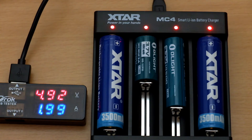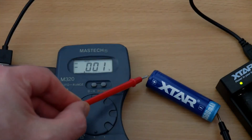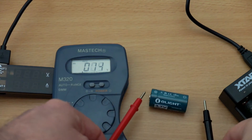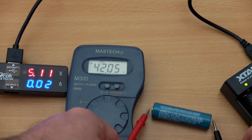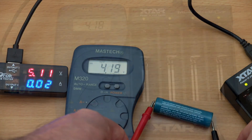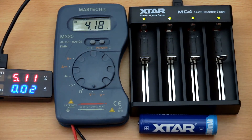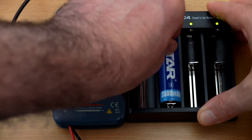Inserting the batteries for termination tests — you can see clearly when it's charging as the LEDs are red, then they turn green when finished. One downside is you won't know how far into the charge it's gone. In the termination tests, pulling them straight off: 4.2 volts, 4.19 — that's spot on. Next up the smaller cell: 4.18, 4.19, 4.2 on that one, and with the Xtar 18650: 4.18.